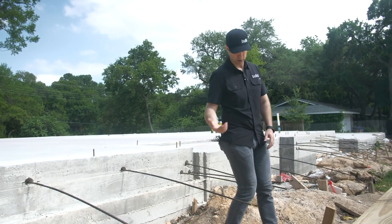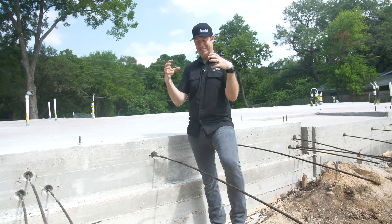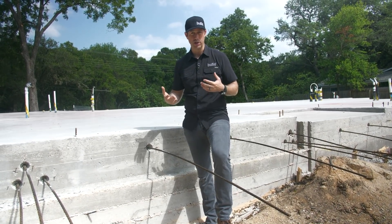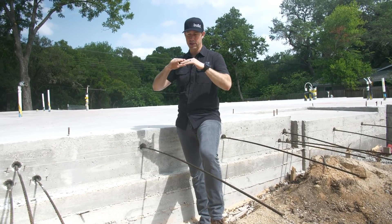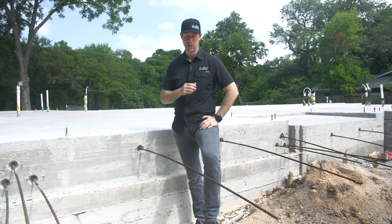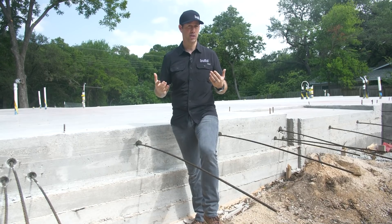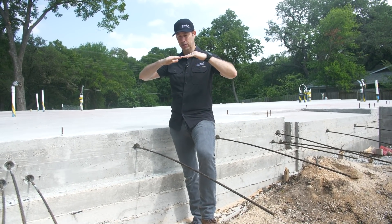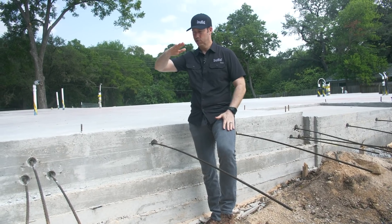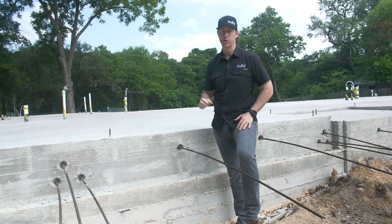One of the massive benefits of post-tension slabs is that by compressing this slab into one big tight ball, the slab is nice and stiff. If you're built on rock, it's not as big a deal. But in a lot of places in the south, we have expansive clays — clays that as they get wet and dry, they move quite a bit, sometimes several inches. There are some neighborhoods in Austin, Texas that see three or four inches of movement. That's worse than the frost heave thaw cycle in the north. If I didn't have a stiffened slab, my slab might actually break. So what we're trying to do is make a really stiff boat that can ride the waves so the whole house is nice and stiff.